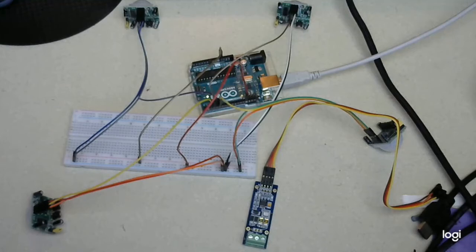I mentioned I was going to look up specs on the power usage on this. Let me find my notes real quick there. I meant to have that up already. In fact, one sec. It is rated with the transformer chips on it at 800 milliamps. Each of these PIRs will draw 0.05 milliamps, and the relay I'm going to use, again, this is assuming that I'm going to need a DC relay. Grab it here. And again, it's beefy solid state.